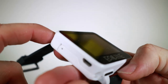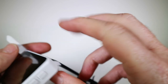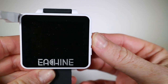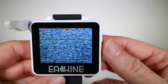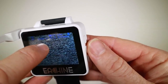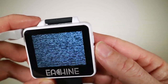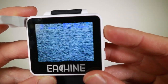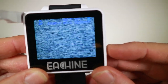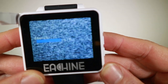Going into how this works: you've got the USB connector, the SD card, the antenna which goes out and then upward, and three buttons. It says 'channel', 'power', and 'RF'. When turned on, you can see the RF band, the channel, and the megahertz readout on the top display, plus a little symbol showing the SD card. The RF button cycles through your bands, and the channel button at the bottom cycles channels. Holding the RF button does a band scan.